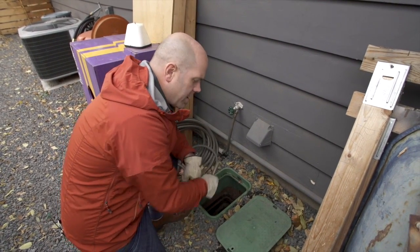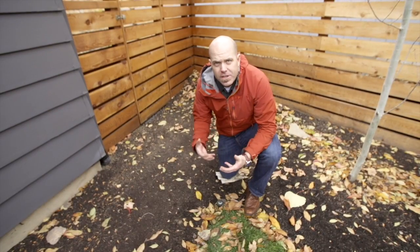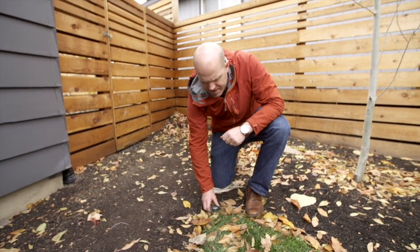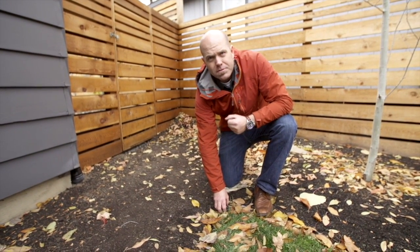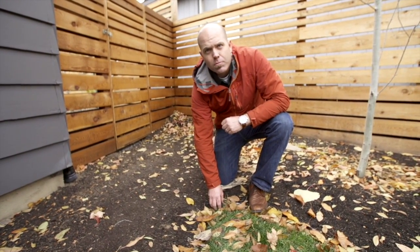When they're all said and done, I'll get more insulation down there to keep things nice and thawed out this winter. One of the reasons we blow out irrigation systems and make sure all that water is out of the system is to make sure these things are protected all winter long. A sprinkler with a little bit of water in it in cold temperatures will absolutely freeze and split along the side, leading to big leaks come spring.